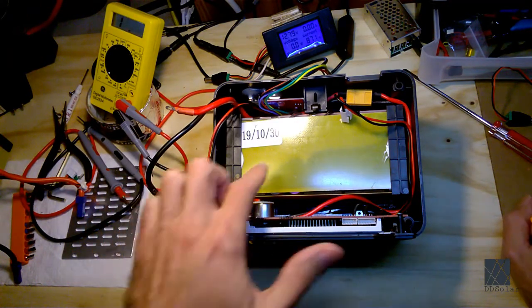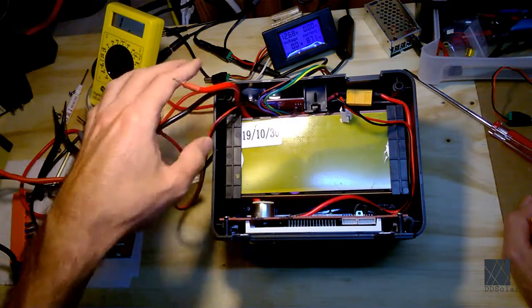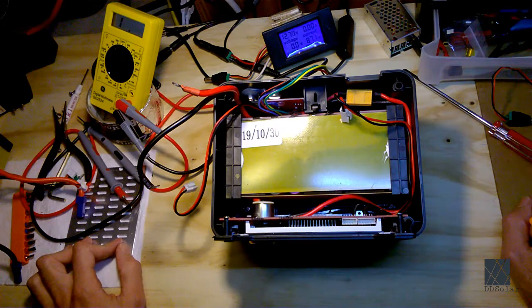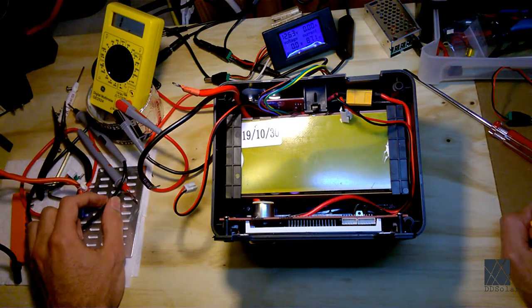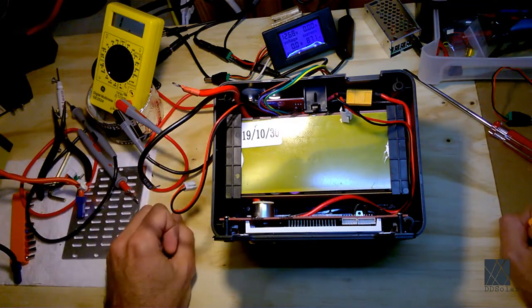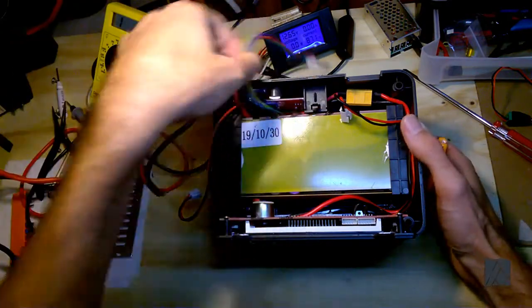Now, I'm very impressed with the way it's constructed. A lot of these units that I'm opening, this is fiberglass, I think. See, that stuff isn't free. And they went out of their way to really make sure this is a safe unit. In fact, so far, if there's a simple short circuit on the input stage on the inverter, rather than just blowing the inverter stage and throwing an error code, it just shuts the whole unit down. They're so paranoid that this unit would be a liability to the customer. Not consumer, but customer. We're not consumers, we're producers.